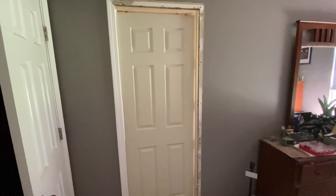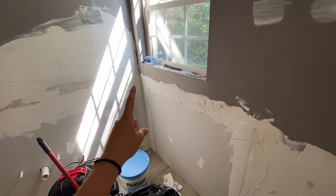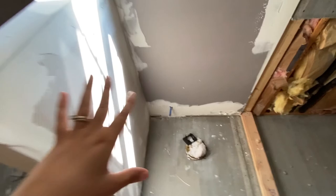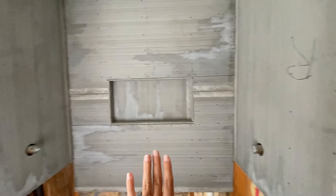Some of the exciting updates in the bathroom — we finally have some walls! This piece is new and that piece is new; that used to be behind the vanity. We've just done the first layer of mud around here, so that still needs to be sanded — we'll probably do it a couple more times. We have it up on the half wall as well, and that's all mudded. We also put in all of the DuraRock board on the floor, so everywhere we're going to tile — which will be the whole bathroom — has DuraRock. There aren't any holes anymore that we're stuffing with old bags. We also have it put up in the shower, which is really starting to come together. I love our shelf — I think it's going to look so good when it's done.